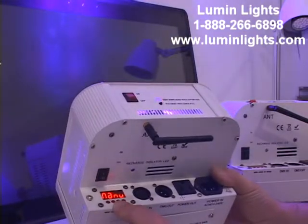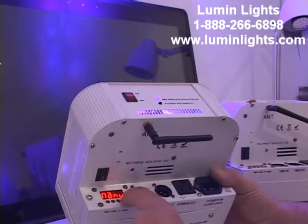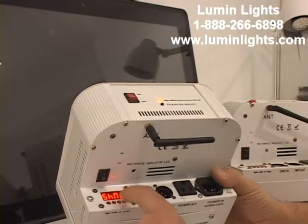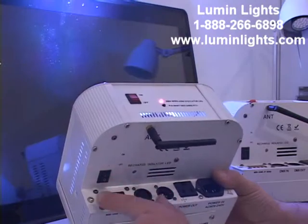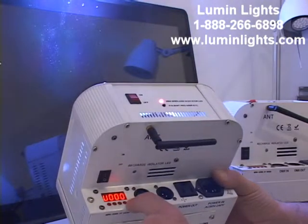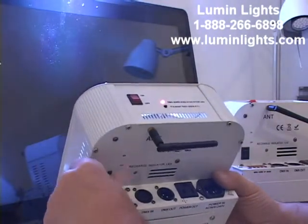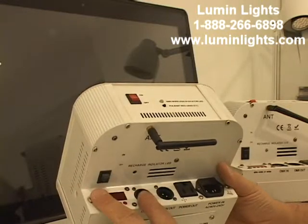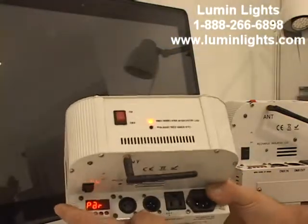Be careful if you set custom colors on jobs — make sure to reset NANU back to full color afterward. If your crew forgets, you might turn on color 6 for amber at your next job and get a weird color. To reset: go to NANU, red is good, green was off so hit enter, up arrow to 255, enter enter. Back out, advance to blue — fine. White was off — hit enter, down/up to 255, enter enter to save. That covers all built-in standalone functions.